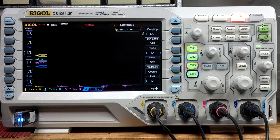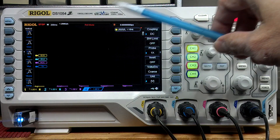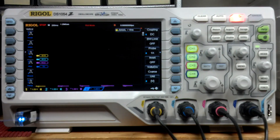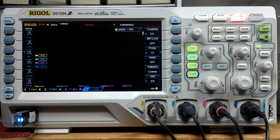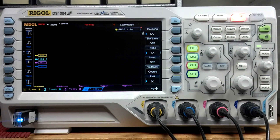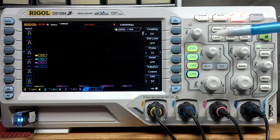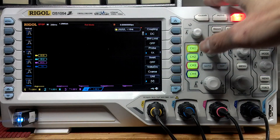Here's how I set up my channels. I've got a four-channel scope. On channel 1 I hook up to GPIO0 of the ESP. I'll show you how I set up custom labels — I thought it was pretty cool that this scope could do that, I'll show that at the end of the video. On channel 2 I hook up to GPIO2, and that's the pin the ESP uses when it boots up — if that pin is low it will wait for new firmware, so I have a pull-up resistor so it won't try to do a firmware update. On channel 3 I have the VCC just to show the little fluctuation on power when you first turn it on. And then on channel 4 I have the TX, and that's where it's going to get interesting — how does TX and these channels interact with each other.